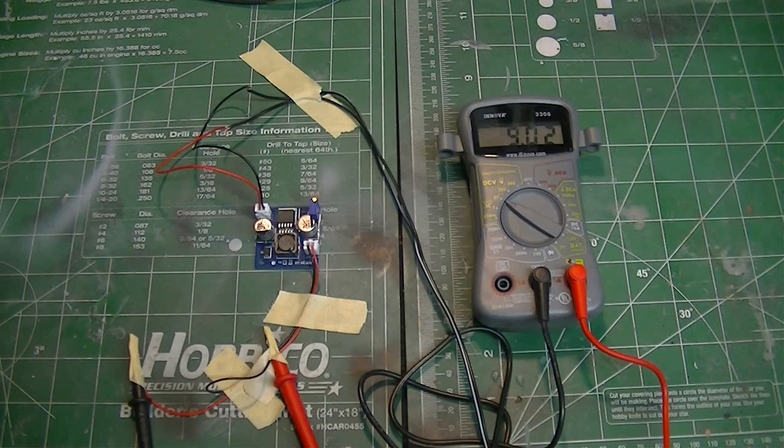Now there's a simple way you can do that — connect a couple of resistors across your power source and cut your voltage in half, so nine volts would become four point five. But since the Monsters in Motion board is a chip-controlled board it might be sensitive, so I thought I might need a cleaner signal. I decided to order a specific voltage regulator that's set up to run a nice clean signal on the output side.